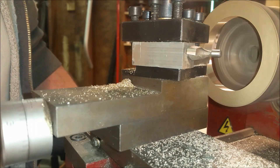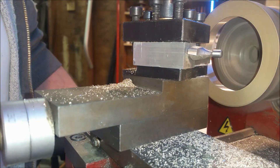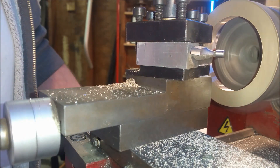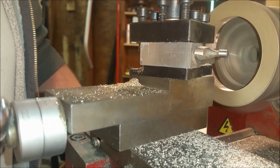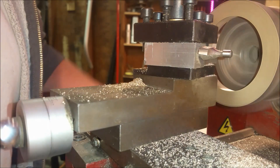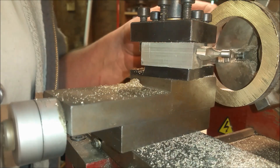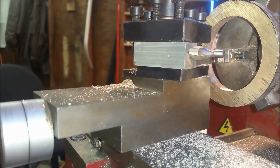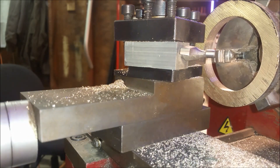This will be my final cut here, and I will be sanding the inside of this as well. Now I've got a five-degree relief angle there on the inside. I'm going to go ahead and face the back and I'll be right back.